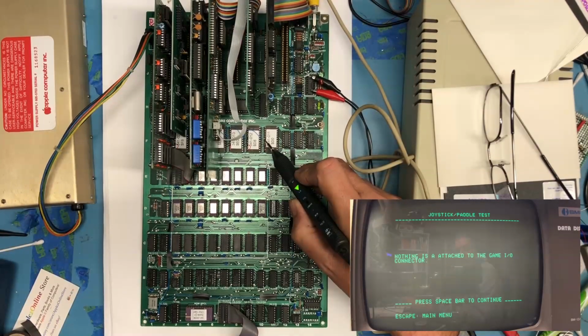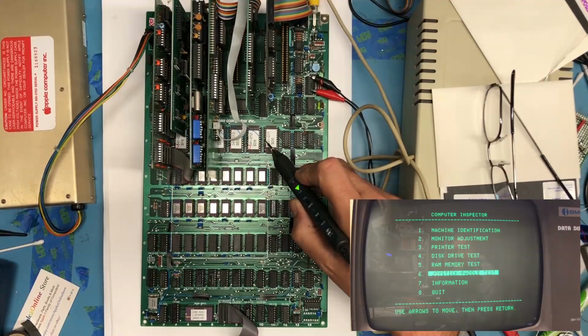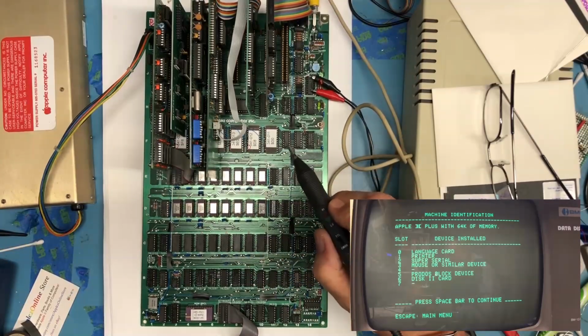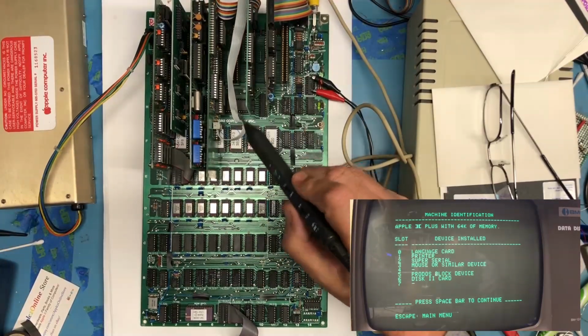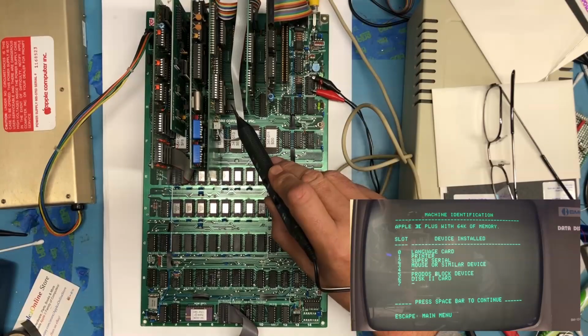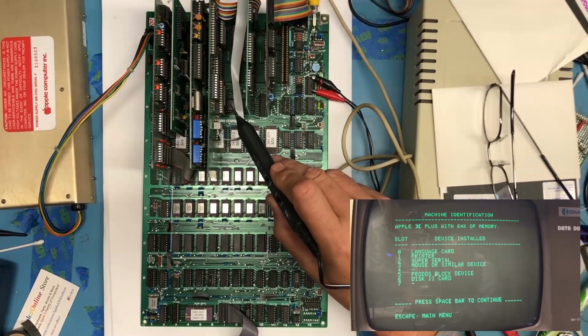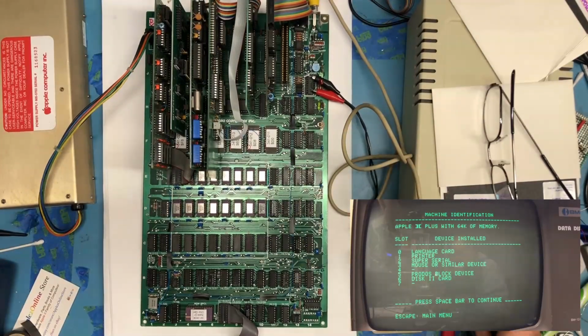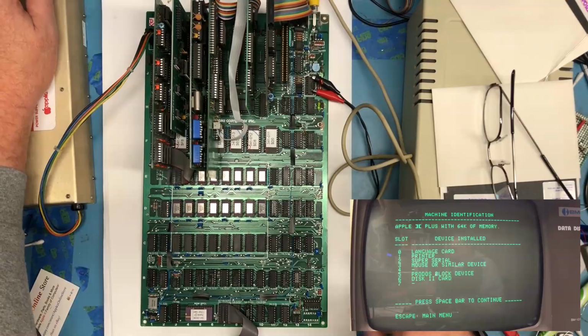As far as I can tell, nothing is connected to the IO game connector. Well, it's a good sign, however, that it did see the mouse card, so it's able to go out and query these cards and figure out what they are. And the mouse card again here has about 2 EPROMs on it, it looks like, perhaps. Which means, again, I'm sure it's driving that inhibit line.